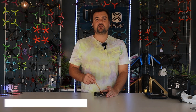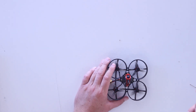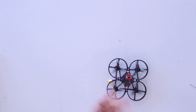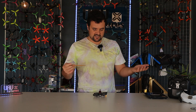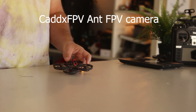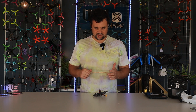Let's have a look at some of the components. We've got some tiny little Gem Fan props on the outside, a little 4-in-1 flight controller in the middle, rocking Betaflight, which is pretty standard stuff nowadays — check some playlists down below if you don't know what that is. It flies really well. I've got Express LRS; it was pretty easy to set up — I just had to put in my binding phrase, and Bob's your uncle, you are off to the races. And then I think it's the Ant Cam on top — I'll put a picture on the screen. It's giving back a nice, clear, colorful picture, and yeah, all in all, it's a little pocket rocket.